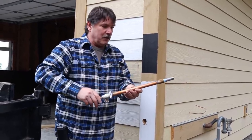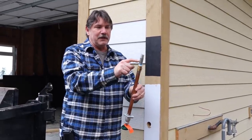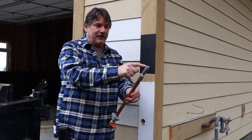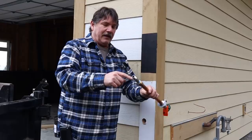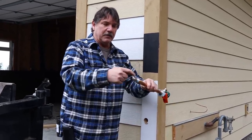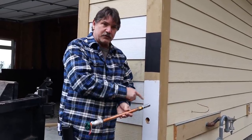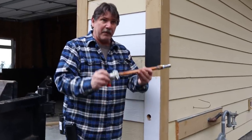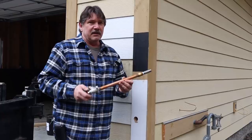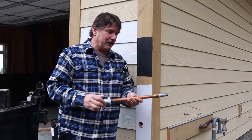When we install these things, I tighten this nipple up a little bit tighter than it's going to get tightened, so when you unscrew it later when that breaks, this comes out. It's really hard to put teflon tape on a female thread — the inside. You put it on the outside of something, that's how you want to seal it, because there's no way to look and see if it's dripping after you reinstall one in the wall. They're a nightmare. I hate them. I avoid doing it because you shut the water off to the house, you go down and get the right length, and they're all different.